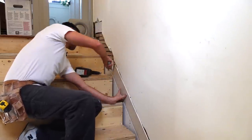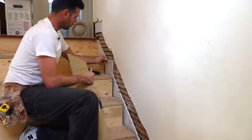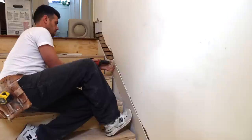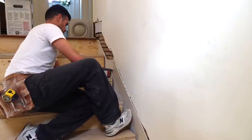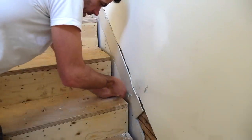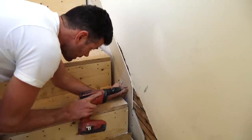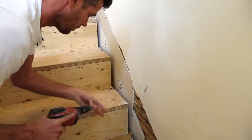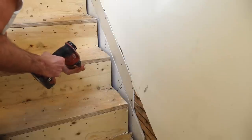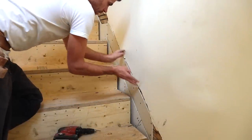There's a funny little joint right there, so we'll give it a quick score. There was a big hole where there was no lath. I'm going to cut this one right here on the stud. You definitely want to make sure you get it fastened into the old studs — it helps suck everything back into the wall. I also throw some screws into the lath as well; I find it doesn't hurt.